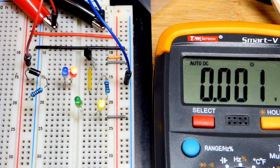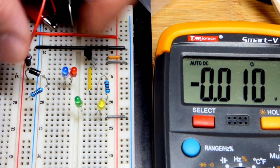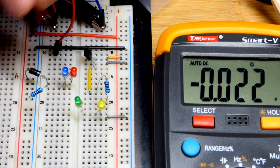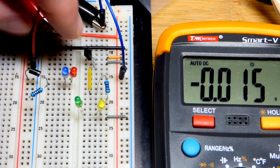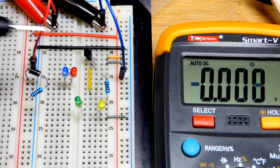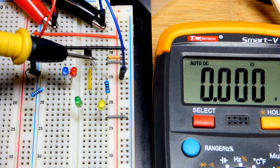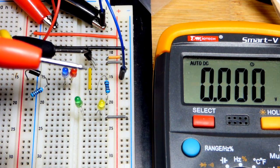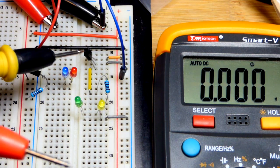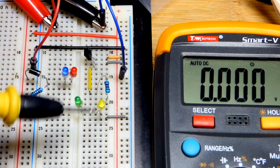In any case, it's a p-channel MOSFET. Right now it is wired unusually as a diode. Let's not short circuit anything, let's try to keep good. So I'm going to put negative to the positive rail, positive to the negative rail. Right now the p-channel MOSFET is actually wired so drain is to the negative rail, because remember we got the reverse bias. Source is to the positive rail, and then the gate is to the positive rail. That's normally how you wire a p-channel MOSFET to be off. So right now it's actually in a normal off position, but we're just doing that to protect the circuitry.